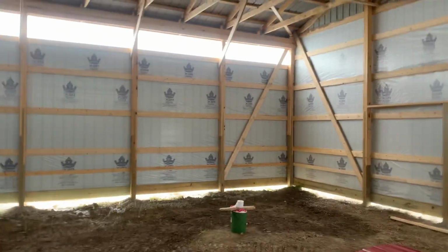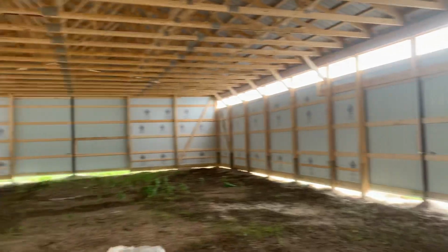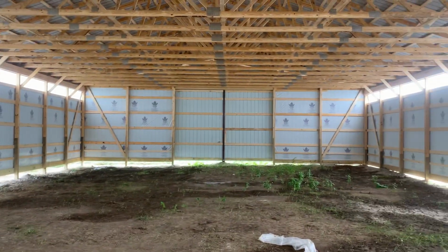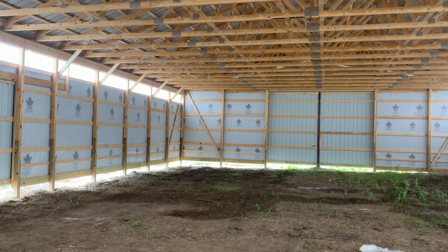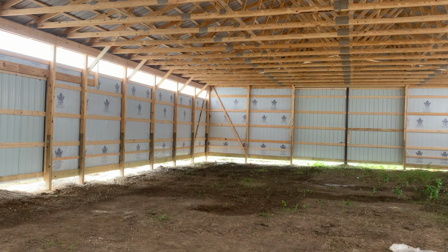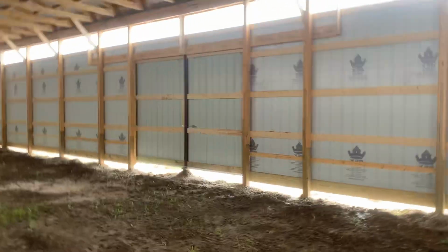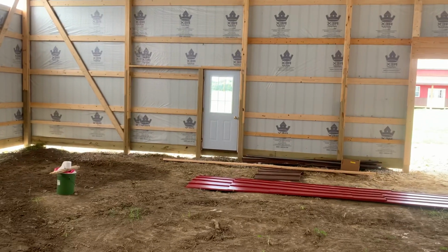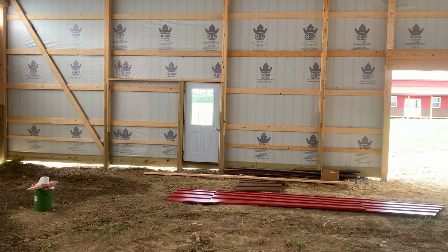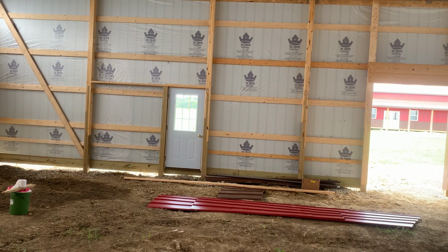And then we use not Eastern spruce, but Western spruce. The difference between the two is Eastern spruce comes from like Montreal, the eastern side of Canada. Western spruce obviously comes from the other side, Vancouver. And the density, the strength of that lumber is a little bit different. So we use Western spruce, and you saw there on the board markings, 2100, which is tensile strength about 1,000 more than a number 2 grade board. So that just kind of gives you an idea, not to pump our chest or anything, but when we're doing a building, we like to use good quality lumber, either 1650 or 2100.